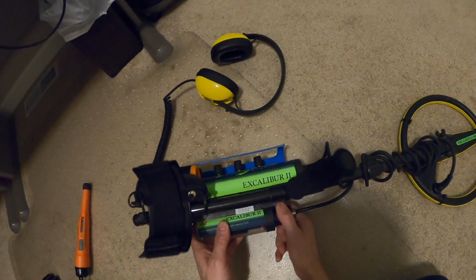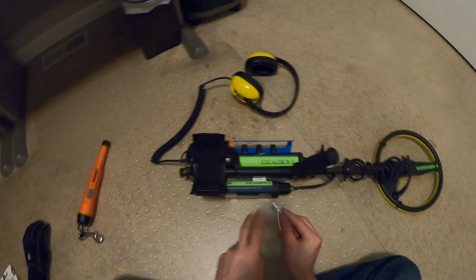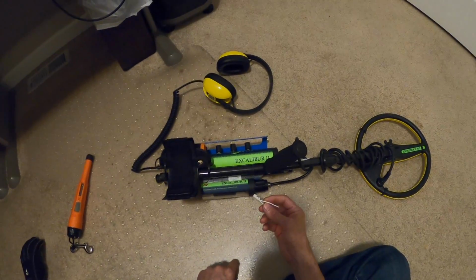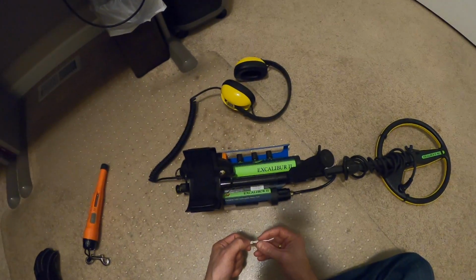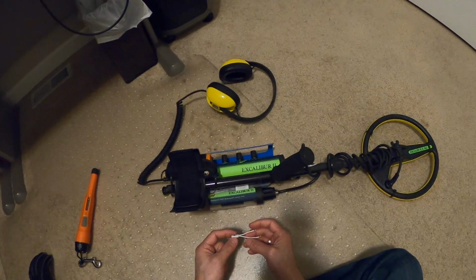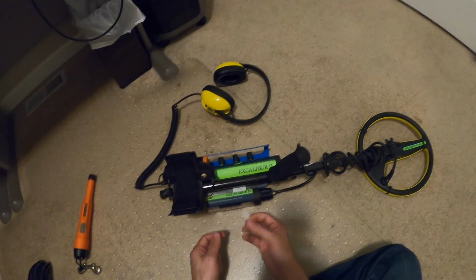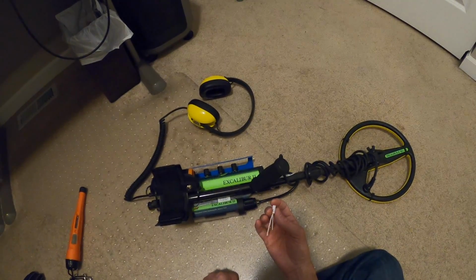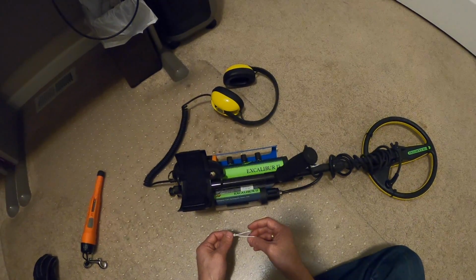So a lot of things that we've seen in the past with the underwater gear is that sometimes they use a magnetic reed contact. Basically, you've got a switch in there, just like your door alarm contacts you've seen for years over the doors in buildings and homes, alarm systems. Basically, you bring a magnet close to it and the switch closes. Take the magnet away, the switch opens. I actually had this wired in. The first switch I bought did not handle the inrush current when I turned this on, and the actual contact, this one here actually was the first one, it actually welded itself or stuck. It's stuck closed now. It doesn't even open, so it's always on. I got another one with a little bit of a higher current rating for the inrush current, and this was the interesting concept.